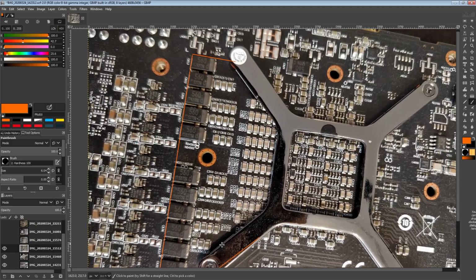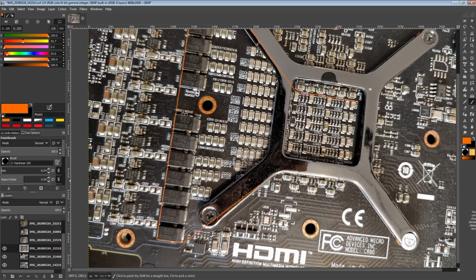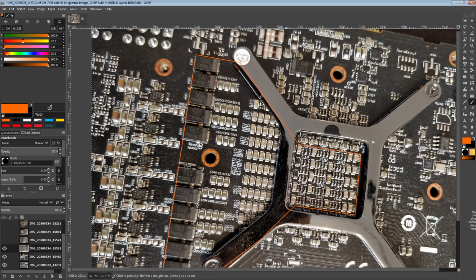Let's go back. The thing that the actual PCB of the GPU affects is this configuration right here. I'm not sure about this row of capacitors, if they're VCore or maybe HBM. Haven't checked. I don't have schematics for GPUs, unfortunately, and there's not really much I can do about that. But at least this much is definitely VCore. And so you just have this huge capacitor configuration here.